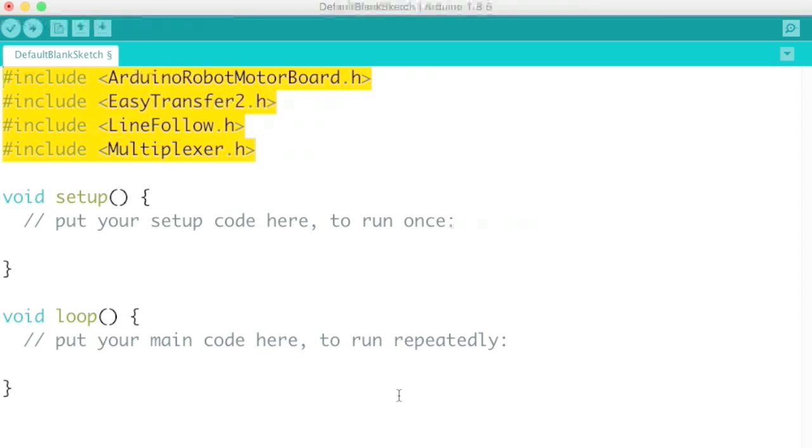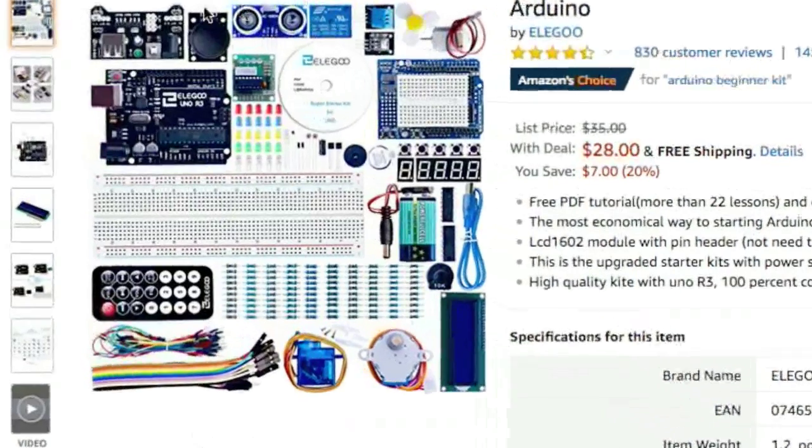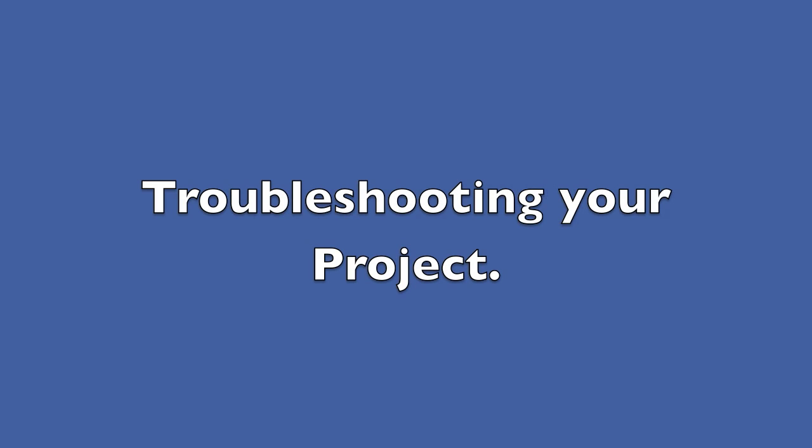Like the soldering project, you learn by doing. I'd recommend an Arduino kit — for example, here's one for $28 that includes an Arduino Uno clone, hookup wire, dozens of parts, and a breadboard. This also lets you program the ATtiny85 using the Arduino itself. It comes with a CD with tutorials and dozens of different projects. If you can't get the software to run on your project, you may be missing a core or a library — just go back and check everything.